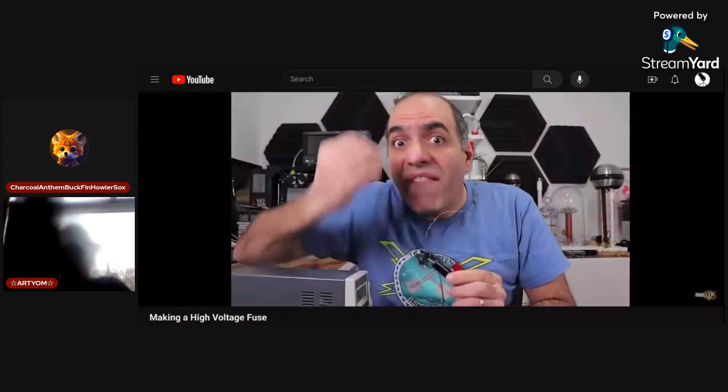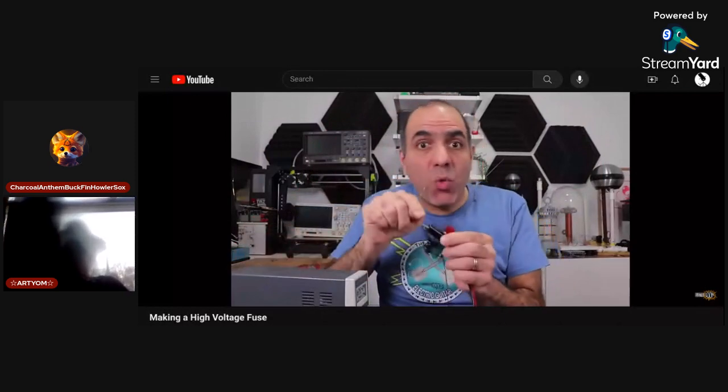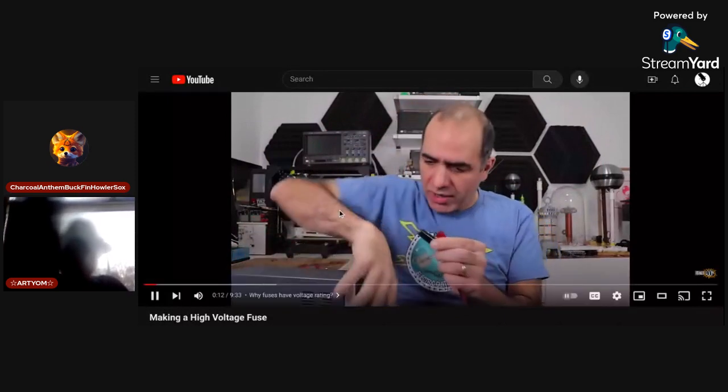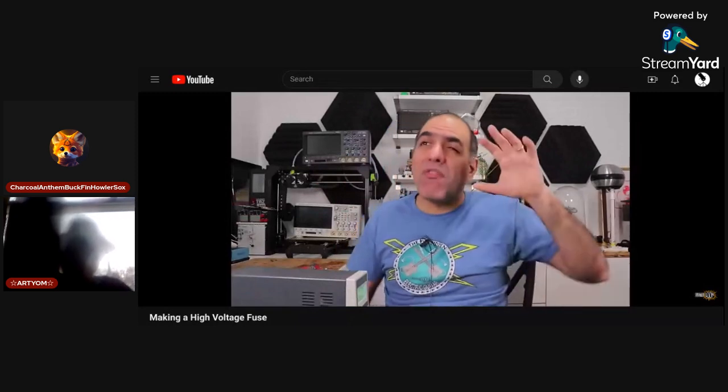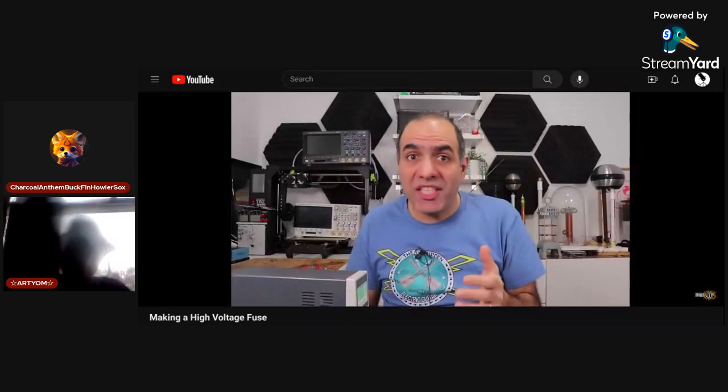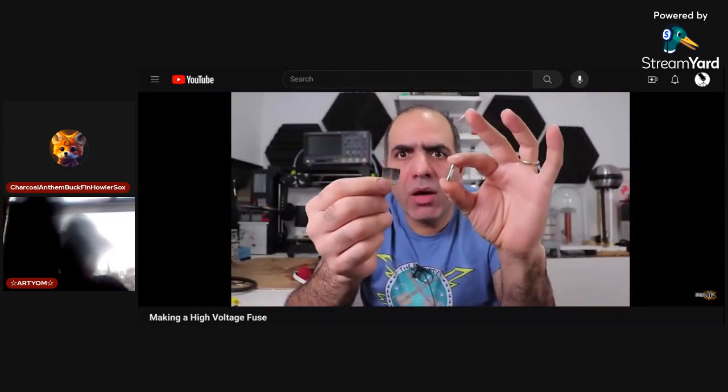We all know what a fuse is. It's a piece of wire that melts open under high current. And let's not get burned. When it burns, it cuts your circuit open, stopping the flow of high current and protects your circuit against fire and such. Every one of them has a different current rating depending on how much current your circuit normally needs and at what level you want them to blow open and protect your circuit.